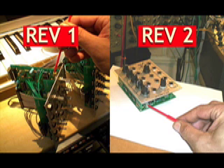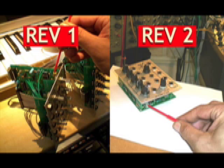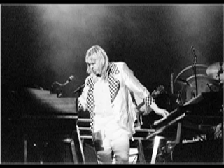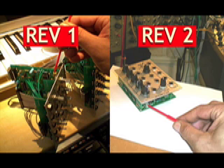I'm adjusting until it sounds right. There we go. Now let's go back up to C5 — four octaves — a little more adjustment. That's getting closer. Okay, that's four octaves. I want to point out that the tools I'm using are a Novation MIDI-to-CV converter, my oscillator, and my ears. There's no test equipment, no tuner, no frequency counter. Let's continue — one more octave — the keyboard and oscillator are out, then back in. Let's go down the keyboard and see.